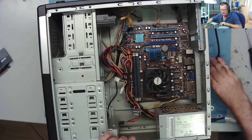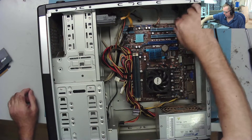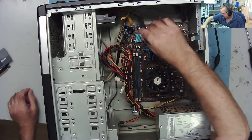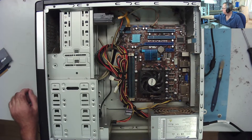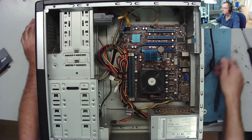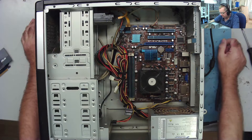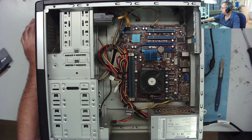Graphics card out, straight onto the onboard VGA. Let's remove some dust — capacitors look okay, electrolytics looking all right. Let's see if it wants to boot from the onboard video. And again nothing — no beeps, though I'm not sure it has a beeper, and no video.